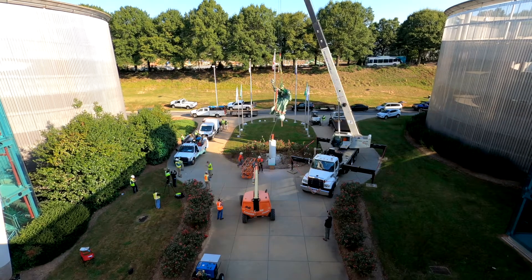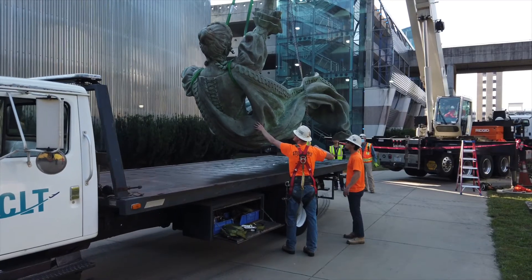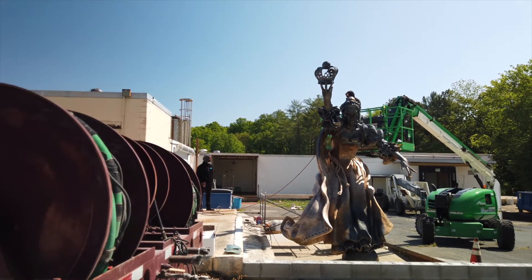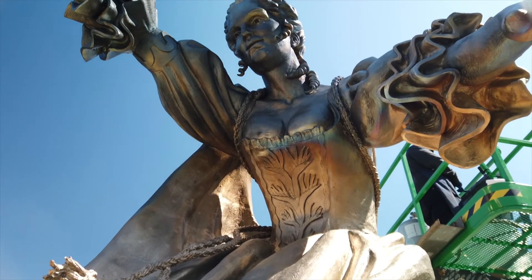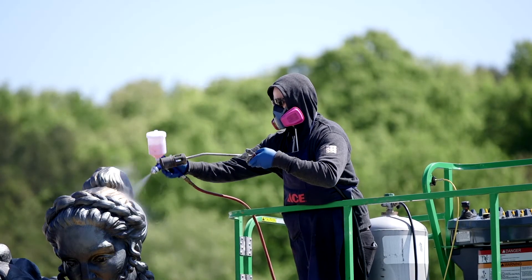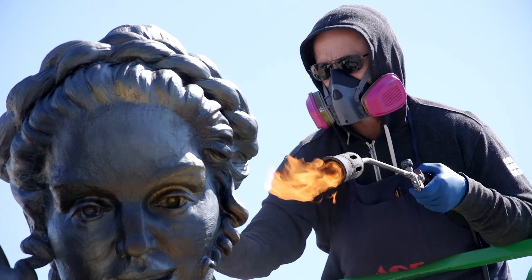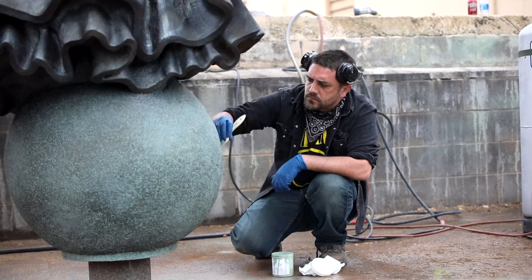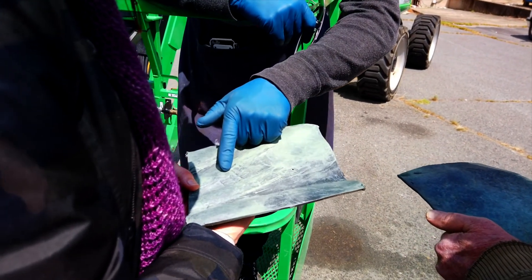The beginning of the process was to have her de-installed at the airport, load her on a transport and bring her to Carolina Bronze. After that, we had a company glass bead blast the finish off so she was bright and shiny. Then the first layer of recoloring — the surface is heated and sprayed with a cobalt finish that turns her very dark, and the final finishing layer is a green wash finish that goes over the cobalt and gives a verde finish.